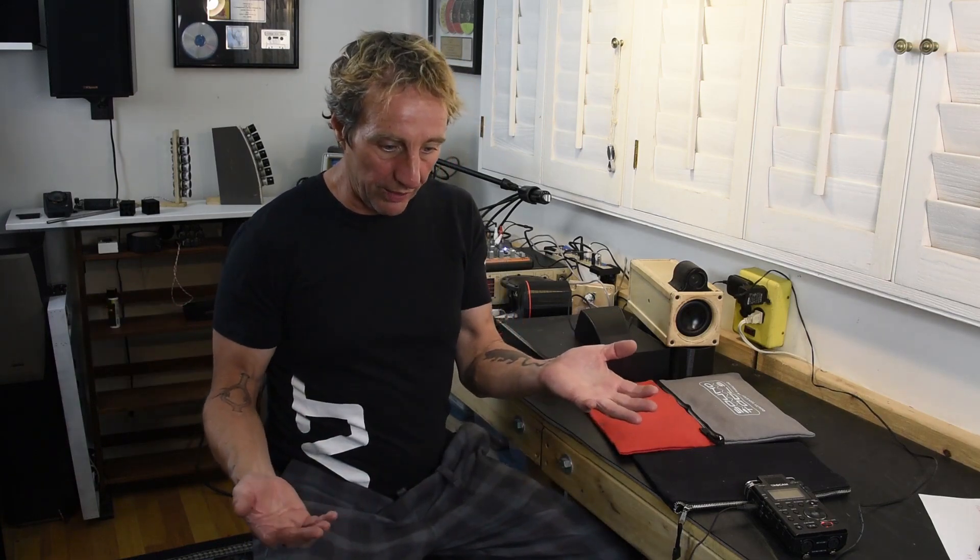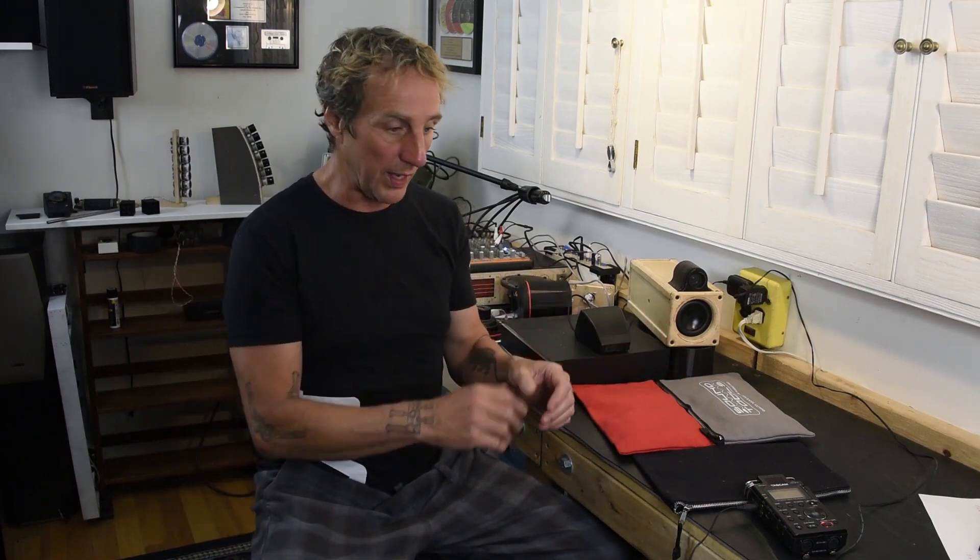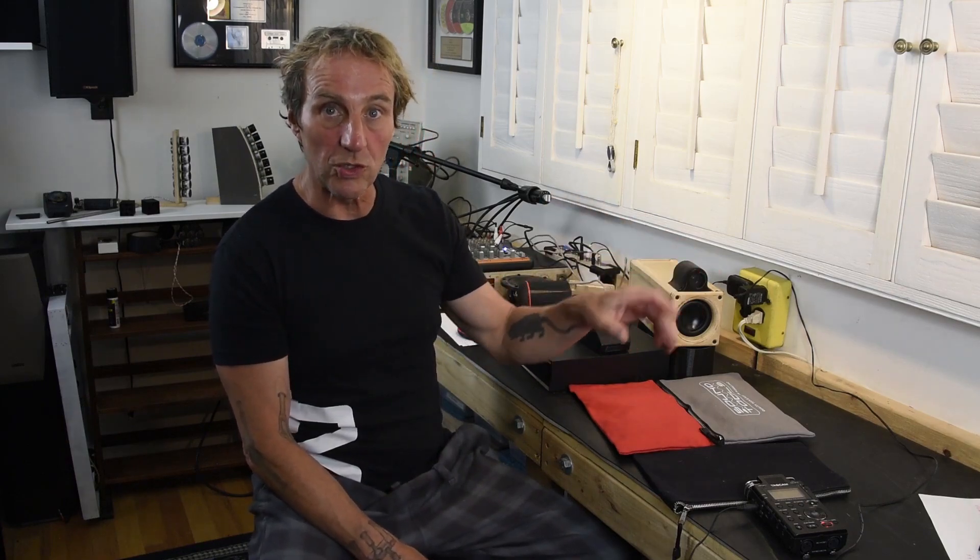The reason this question comes up is when you hit a kick drum. If all your system's wired in polarity — everything's wired correct — a positive pressure wave on the microphone causes the diaphragm to move in, travels through all the electronics, shows up at the amp, the red terminal creates a positive pressure wave, hooks up to the speaker, positive pressure wave, speaker moves outward — out of the box.